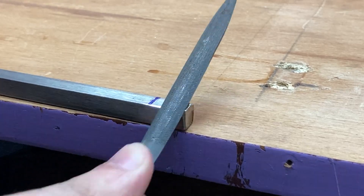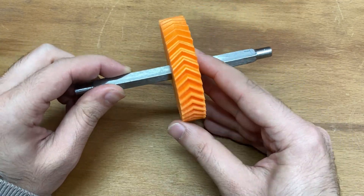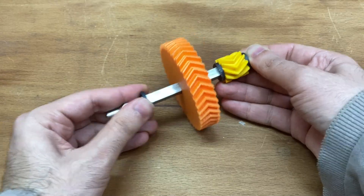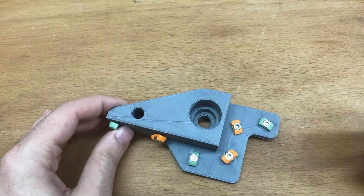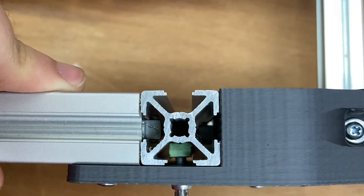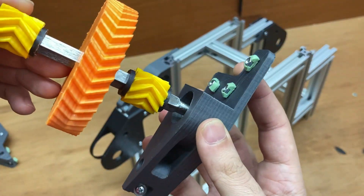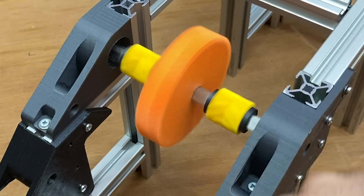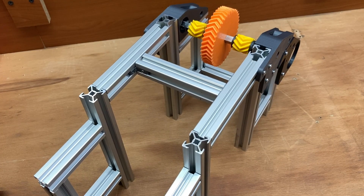I run the shaft patiently because I'm going to place it into bearings, but first let's put the gears on. The reason I chose the square shaft is that it's very easy to connect the gears — no need to cut keyways or anything like that. I fixed the output shaft with 8mm ball bearings and used metric M3 bolts and 3D printed T-nuts to fix them to the chassis.